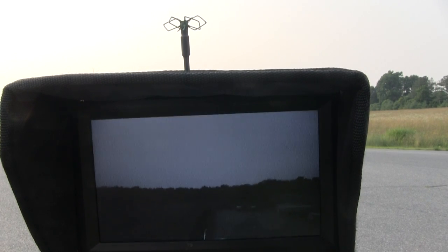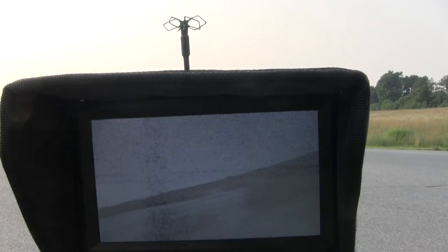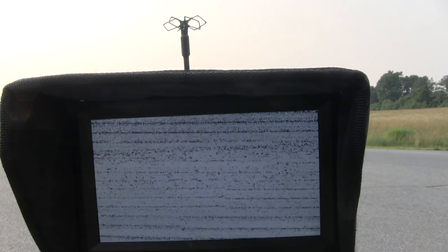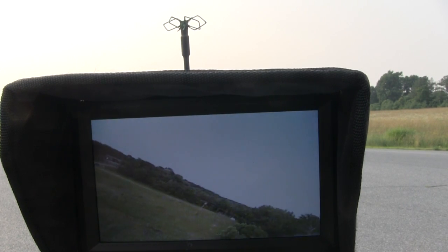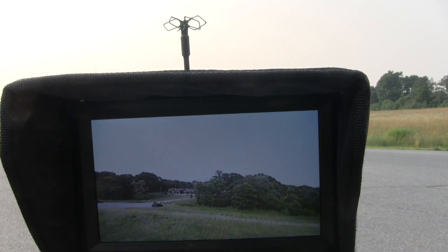Here I'm approaching the quarter mile point. The video is unstable and barely usable, certainly not suitable for racing. I'm also testing some Fresnel Zone violations at relatively close range — these trees are approximately 750 feet from my ground station location. Flying behind them completely takes out my video. For more penetration, we'll probably have to change to a directional antenna.